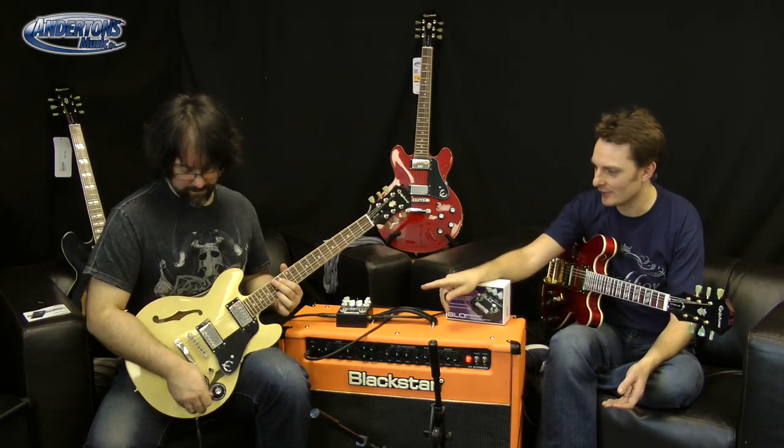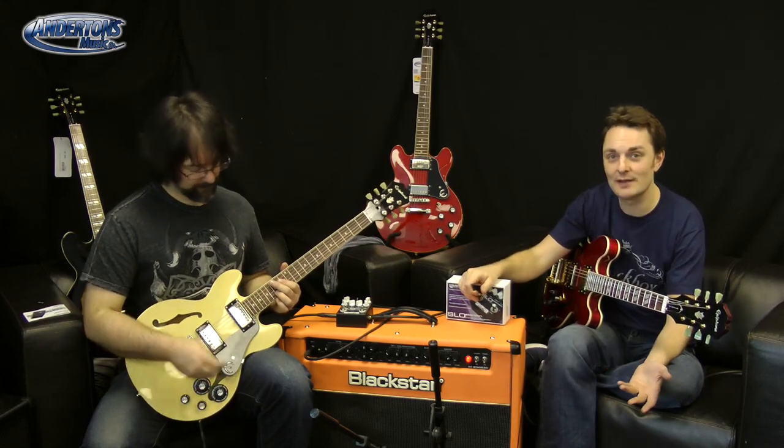It's an awesome guitar. It's got a coil tap - single coil mode. This is a feature not on the American Gibson ES339, it's only on the Epiphone. Here's a great one - why is a humbucker called a humbucker? This is why. Press it in - hear that hum? The hum that a regular single coil makes goes away when you wire it with another single coil and call it a humbucker. That's why it's called a humbucker.